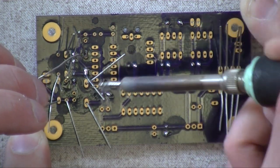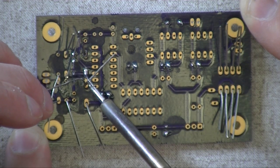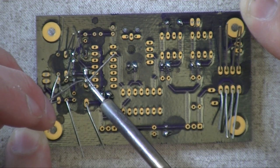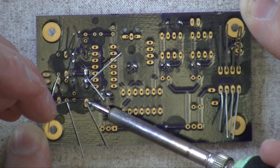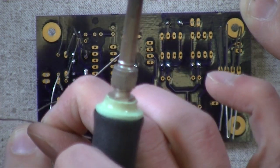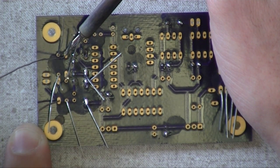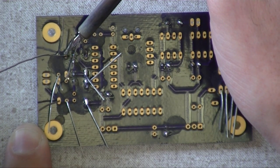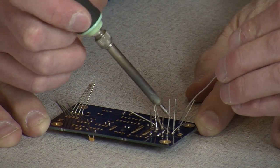We found out the hard way because we thought we cleaned the stuff off once, and the boards were all up and running, and then 6 months later, the residue of the flux absorbed moisture from the air, just humidity in the air, and it turned from a nice, clear, indetectable film to a white, conductive sludge on the back of the board. We had like 30 circuit cards, big 10 by 12 circuit boards, just covered in this white goo, and they stopped working. The problem was they were already deployed and out in the world, and boy, was the customer mad. The customer was a very large automotive company, so somebody we've heard of, probably. You don't tick them off. They get really, really irate when you do that.